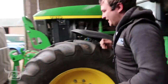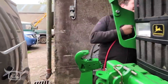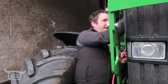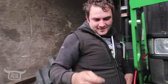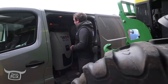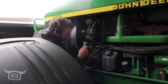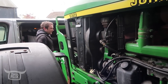So what happens - describe to me what happens to get your aircon sorted. Well, hopefully as you were saying, this setup here is just low on gas. But you can have no gas, or a leak, or a compressor problem, or electrical. So what's the first thing you check? We'll check to see if there is pressure on her. If there's pressure on her, it's usually a good sign, but not always. Pressure on it means it's holding its gas and we don't have any leaks.